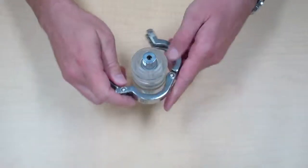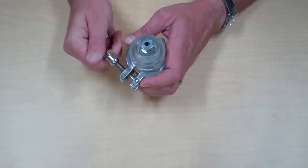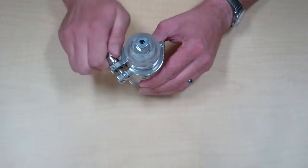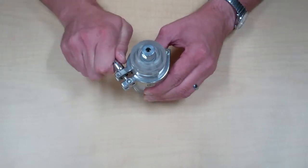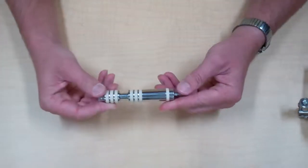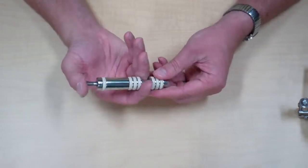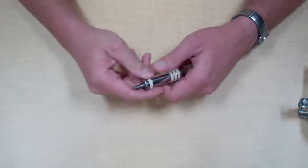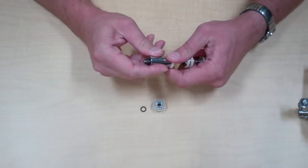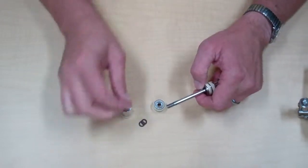You can reinstall your tri-clamp. Moving on to the plunger — as mentioned in the opening, this is a multi-piece plunger with spring-energized seals. It basically just comes apart in pieces. There are o-rings in between each section — two o-rings between each section — so we just pull it apart.